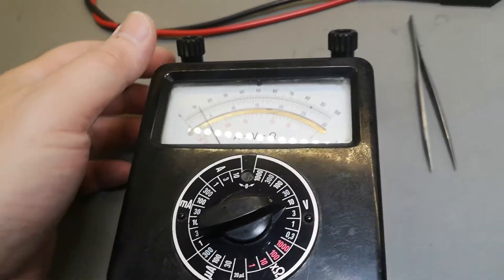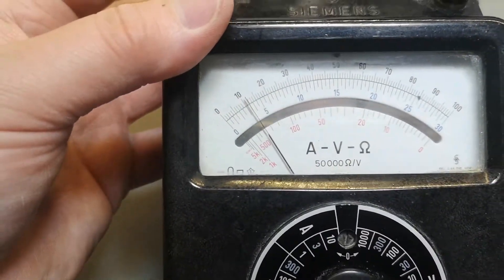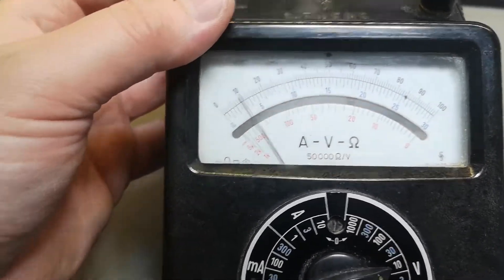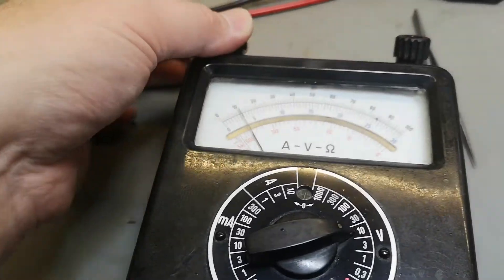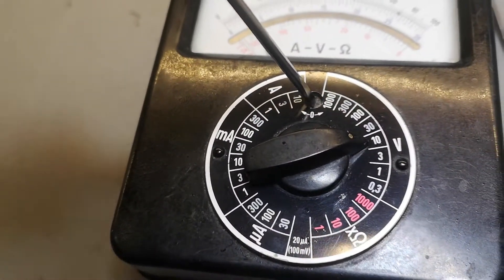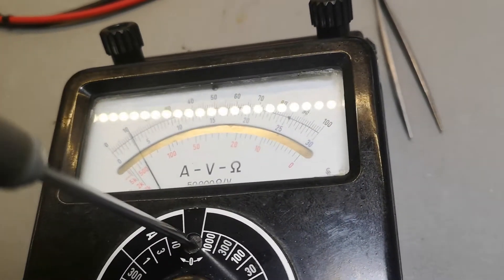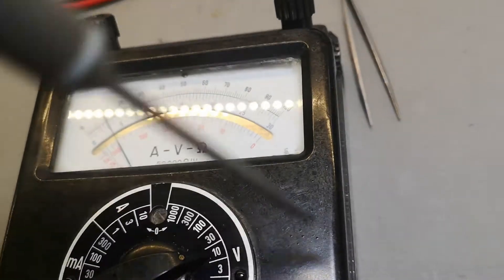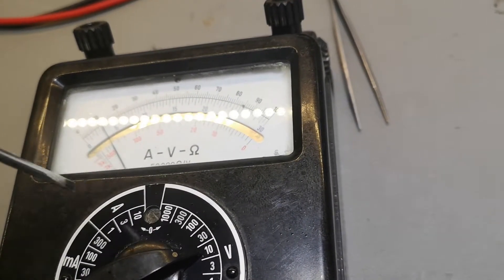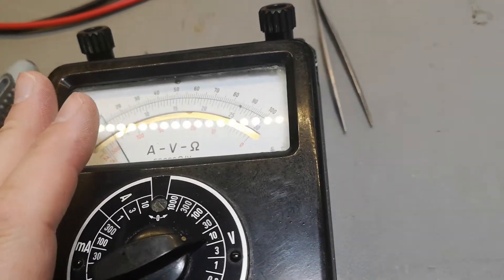The reason why I call this a repair: look at the needle, it is not going down. So that is where the problem is. Also this should be the zero - see, no response. So somebody assembled this and forgot to put this little pointy thingy inside the slider for the meter.